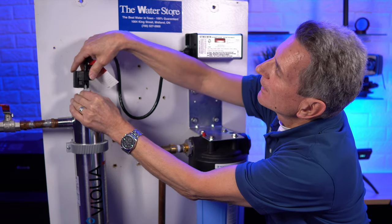Once you've done that, partially open the inlet ball valve — don't jam it open all the way. Let water flow through and check for leaks. If there are no leaks, open it all the way. Confirm the UV lamp is on and showing 365 days. Then open the downstream valve and let water flow through. Open a faucet nearby — you'll see sputters of air. Let it flow until you get a smooth, steady stream.